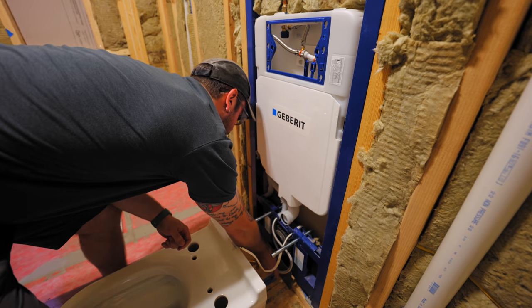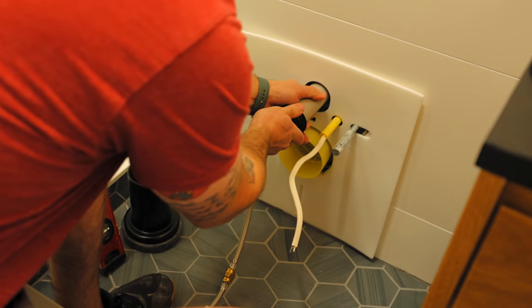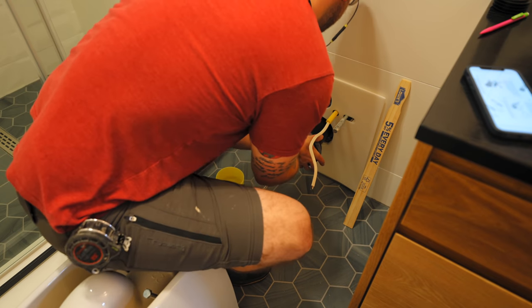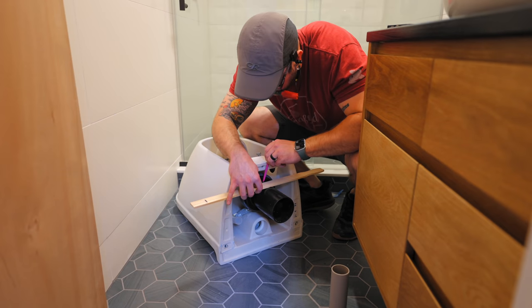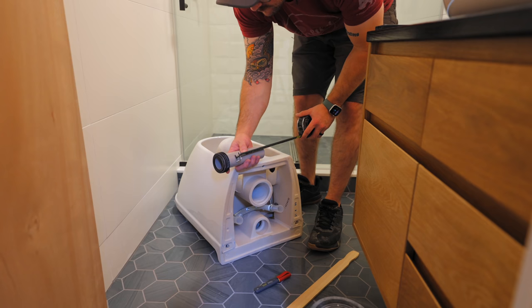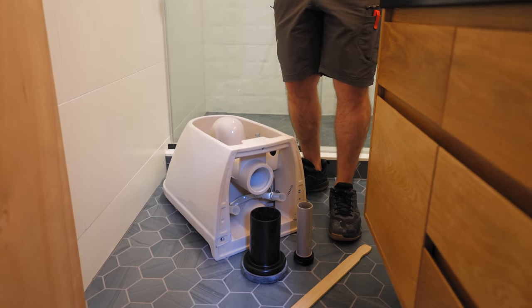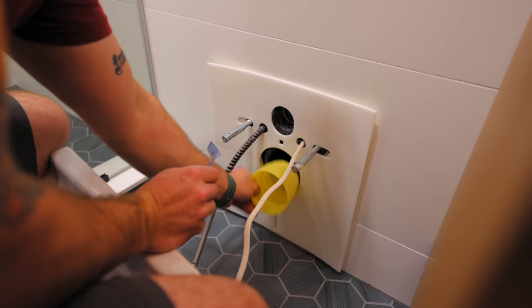I got these connections worked out while the walls were opened up prior to waterproofing, and now three months later I could finally get the toilet installed. The first step was to get the two pipes — which connect the toilet to the in-wall tank and in-wall drain — cut to length. I inserted the pipes into the wall openings and marked where they met the face of the wall, then attached them to the back of the toilet and marked where the pipes intersected the back face of the toilet. I measured the distance between those two lines, added about an eighth of an inch, and that was how much pipe I needed to cut off. I also got the mounting rods positioned, as they're adjustable to work with different wall thicknesses.